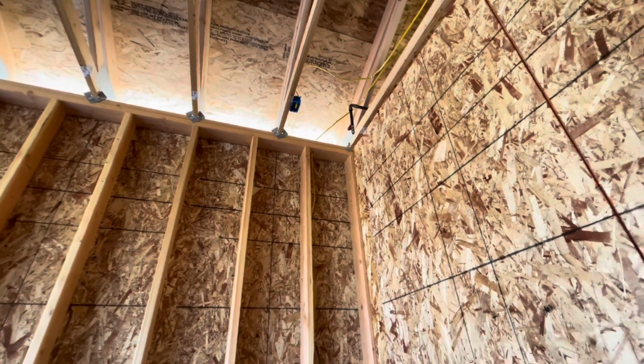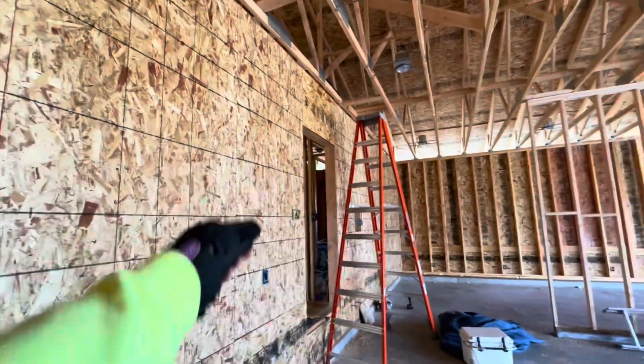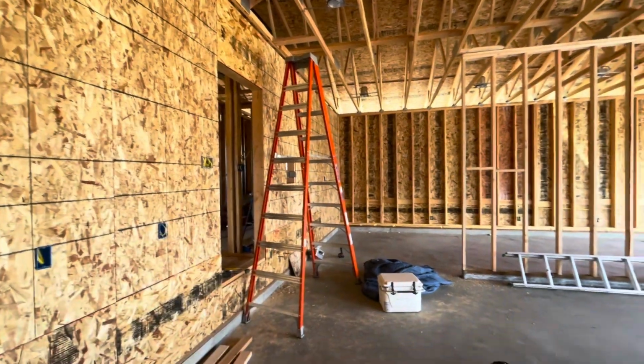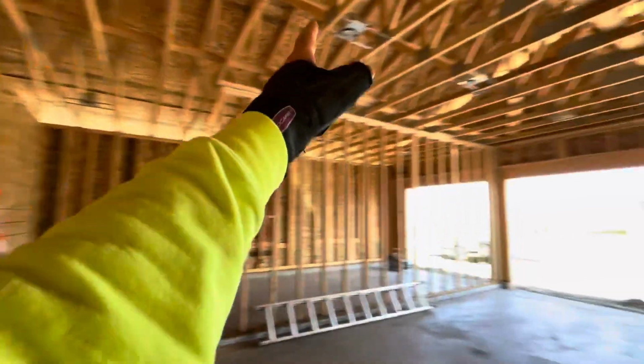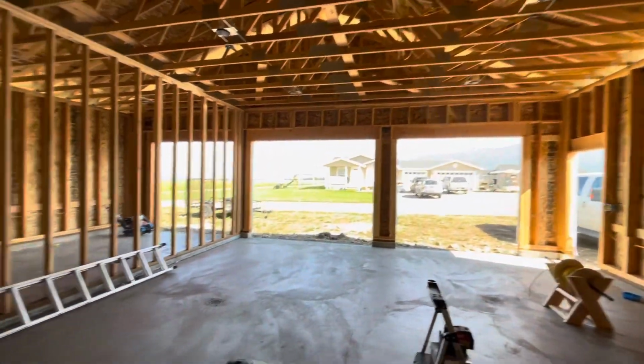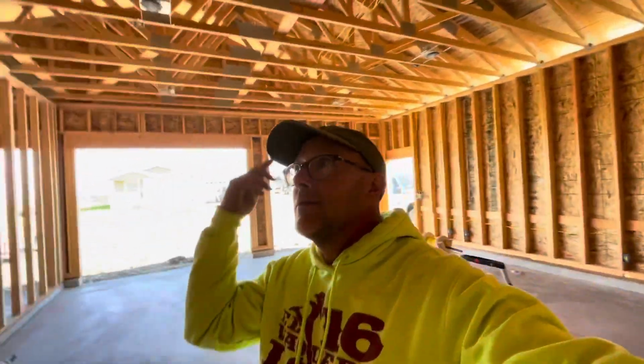And so I redirected that outlet to the thermostat, and then I'll hop over from the breaker to the thermostat. And then these cove heaters, I'll run a wire out here. I'm putting a cove heater above each garage door. Potentially the cove heaters could heat up the space because it will be fully insulated. And maybe I won't need the shop heater.